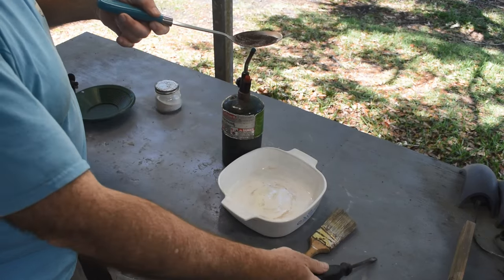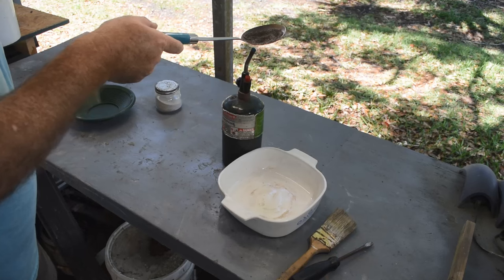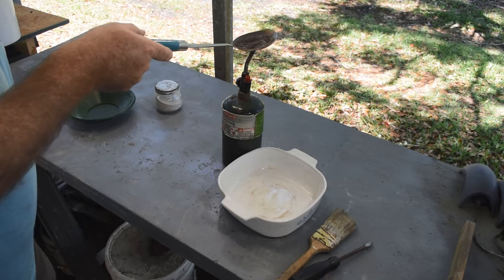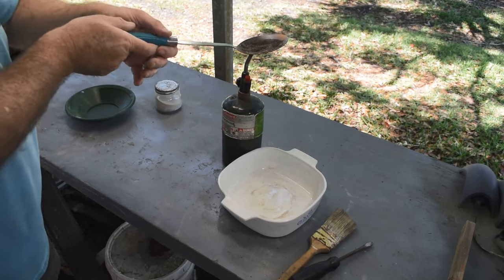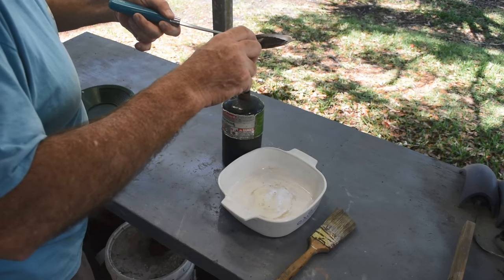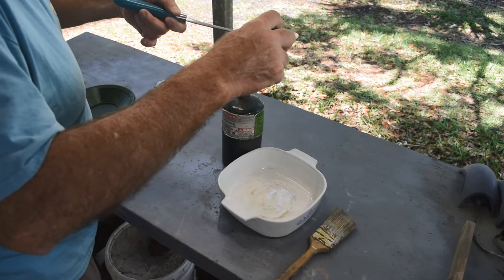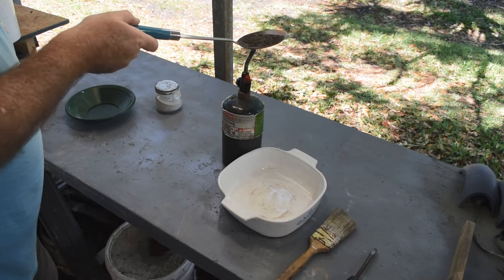I just got a whiff of sulfur dioxide as the wind changed direction briefly. So this is working — not the most convenient way to roast your concentrates but a quick and dirty method. We're getting rid of the sulfur, converting those sulfides that gave Jason so much trouble into oxides, which should be a whole lot less trouble to smelt. There could be some arsenic pyrite in this too — that white smoke might contain some arsenic oxide, so not something I want to be breathing. I'm glad I'm standing upwind.